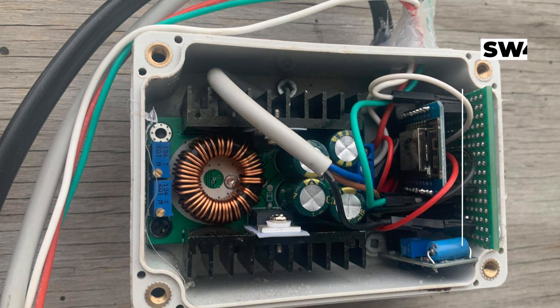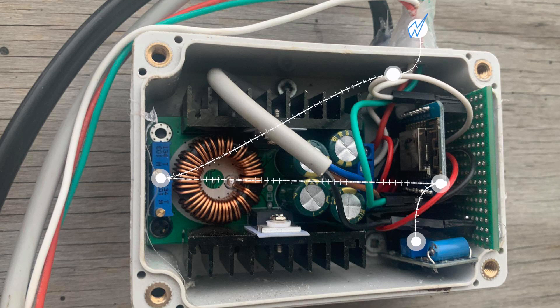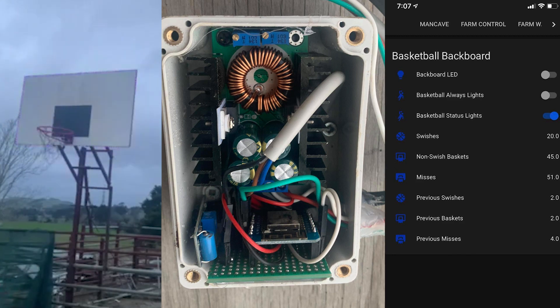The third piece is the actual vibration sensor, the SW-420 motion sensor — a vibration switch you can tune for different sensitivity. When all of this is housed in a 3D-printed box, you have mains coming in at the top going into the buck converter, which translates the voltage down to the D1 Mini, which powers the vibration sensor. When the ball hits the backboard or rim, the whole thing shakes, the sensor picks up the vibrations, and relays that information via Wi-Fi back to Home Assistant — that's how we get the counters on the screen and track all the basketball stats.